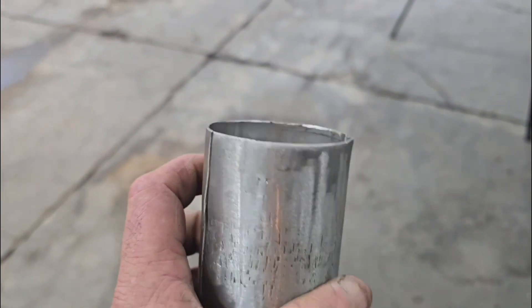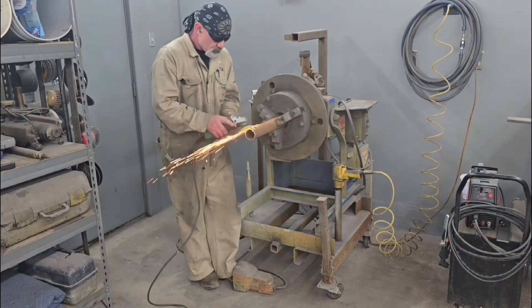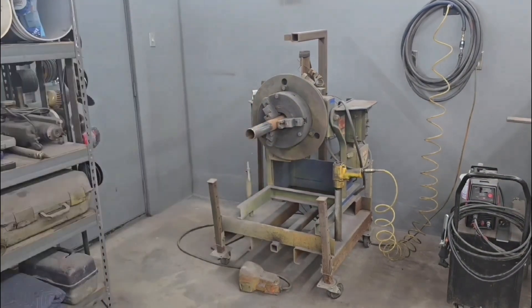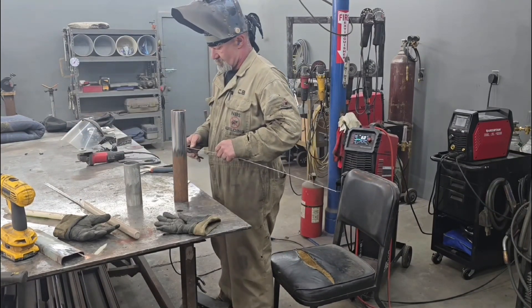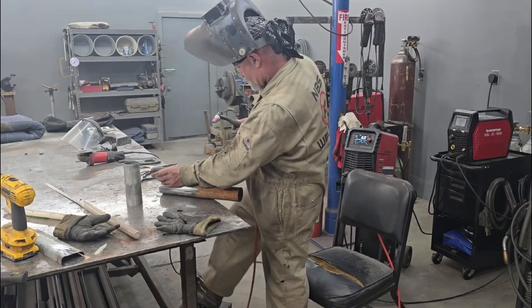Could you get one of these? Well, we don't know. It's two o'clock on a Saturday and my buddy needs this thing moving along. So if I can weld this up with stainless and he can grind it to the shape he wants, that's what we're going to do. The first part of this has to do with getting something that'll fit inside of it, like this two-inch schedule 40 pipe, and cleaning it up so there's no contaminants. The reason for this pipe sleeve is I've got to have something inside to make sure it doesn't get any smaller when I weld it. When you weld on a slit like that, you can almost guarantee it's going to try to get smaller. He slid that over the shock and it's tight — if anything, we want it to get bigger, not smaller.